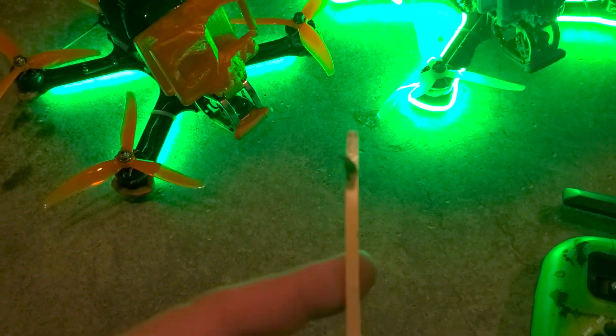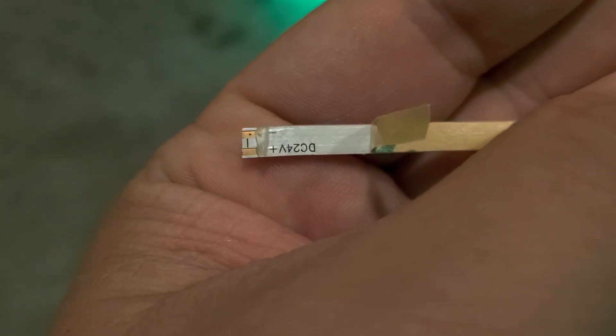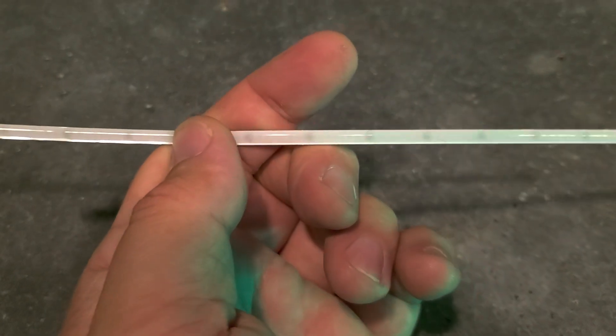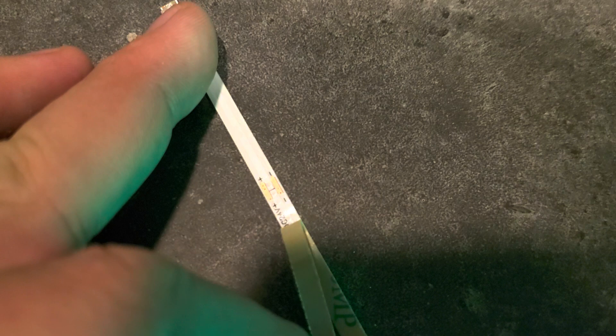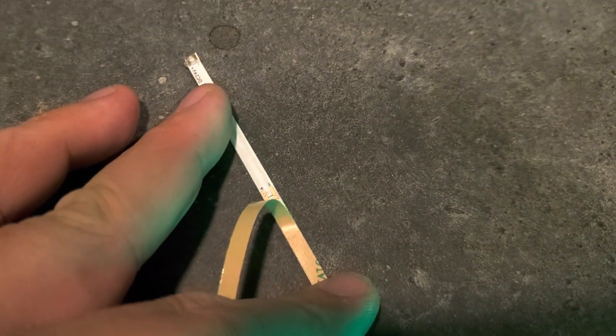The trick is, if you want to segment them — there are LED pads underneath, and every 5 centimeters there is a little black line. The first one is right there, the next one is right there, and the next one is right there. Every 5 centimeters you can cut this thing, and what you'll do is expose another pad. When you expose that pad, you just split it right in half with your snippers, and you can solder more of these up in series or parallel.